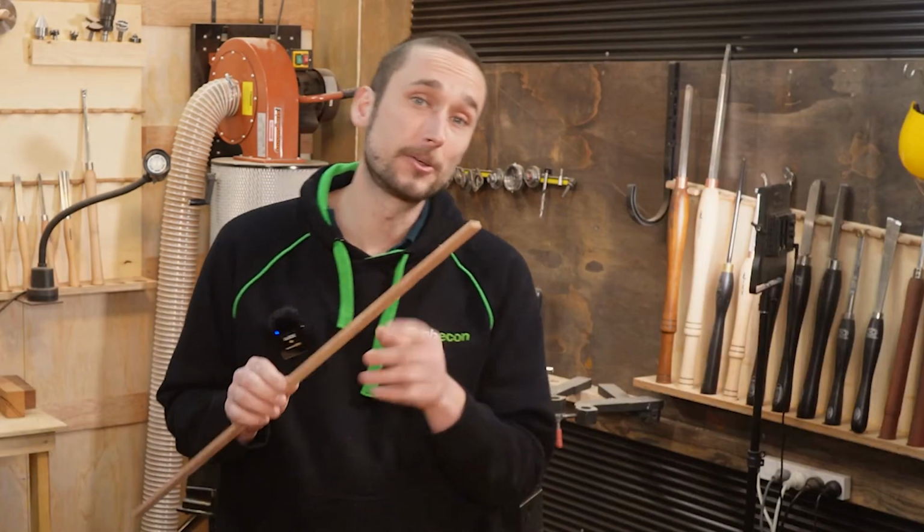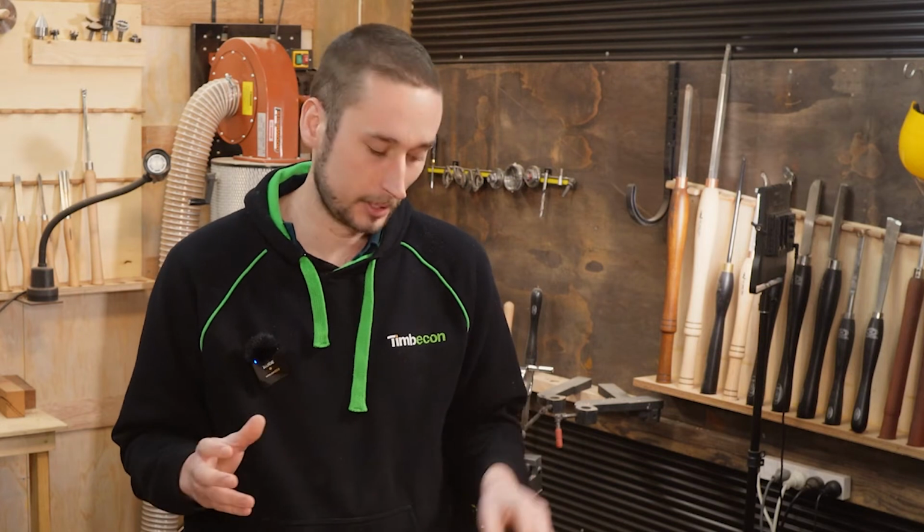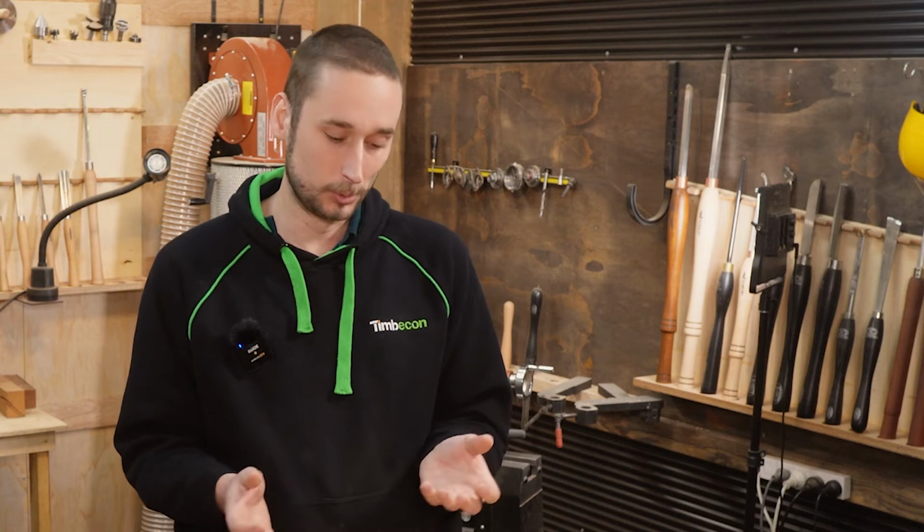The second thing I want to mention is the width of the segments. These narrow strips were kind of a waste of time. They were fine for these smaller diameter rings, and they will be put to use eventually. But the thing I didn't consider is as you increase the diameter of the ring, the effective wall thickness that you can get out of the rings gets thinner and thinner, and it essentially makes them useless. The solution to this would just be to increase the number of segments of the ring, so say you go from 12 to 18 or 24, but I didn't think about this at the time, and I ended up wasting a bit of time cutting and gluing these smaller pieces to then only later realize that I wasn't going to be able to use them. It's all part of the process and I learned from it, so still a win in my book.